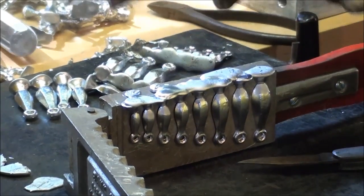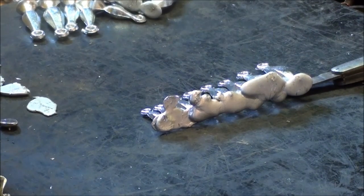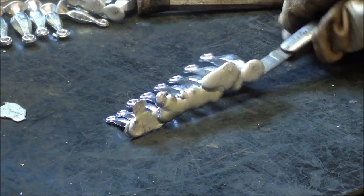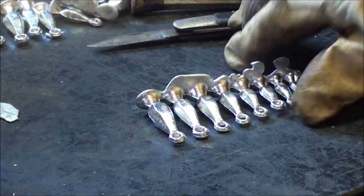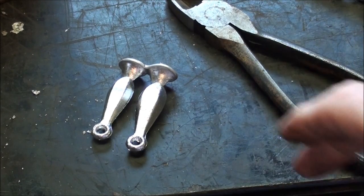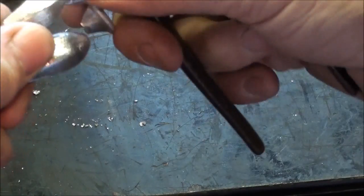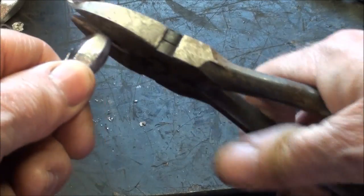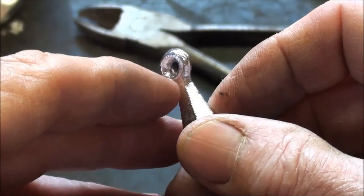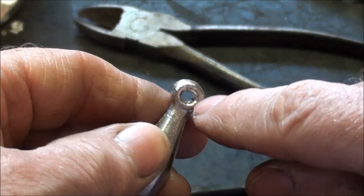A little trouble getting those out because some metal went over the other side of the mold, but they all came out at once. Point those at the camera Jordan — flip them over so viewers can see. To get these sinkers ready to use, take side cutters and nip off the gate, then remelt those little gates. Along the parting line you sometimes get a sharp spot that could cut your fishing line, so I like to take a drill bit and ream the hole out quickly with a hand drill.